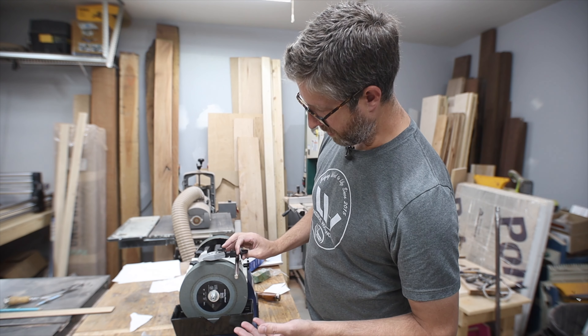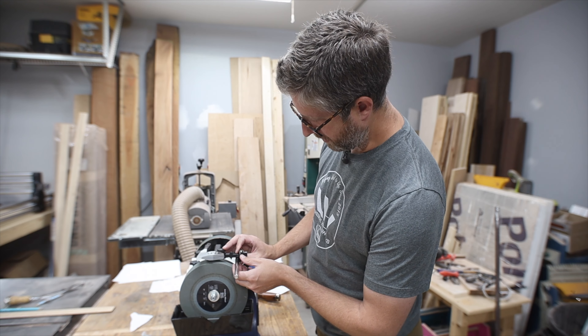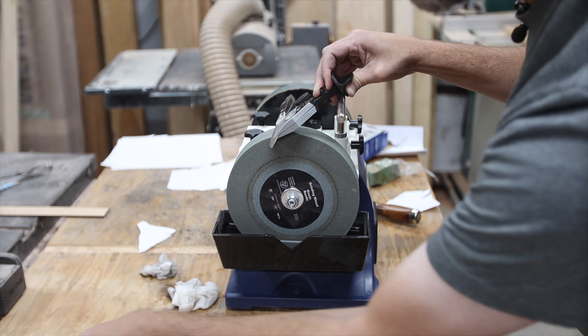Then you've got to find the angle. See how this is way too low from where I was doing the chisels because that jig was so much higher, so I've got to readjust. You can use either of these positions on the bar — the smaller one for larger knives like this, and the larger one for smaller knives. Typically knives like this are about 40 degrees total, but you have to cut that in half because there's a bevel on both sides. So you'll do 20 degrees on this side, flip it, 20 degrees on the other side. We're going to use the 20 degree measurement and get this set.